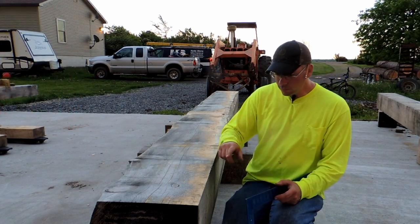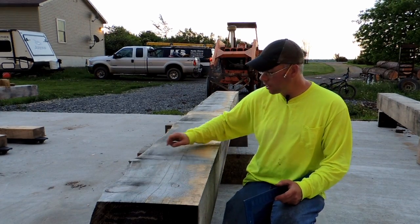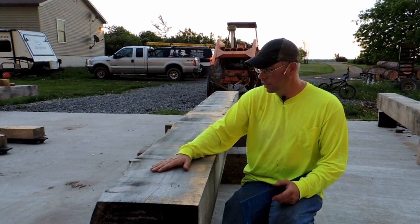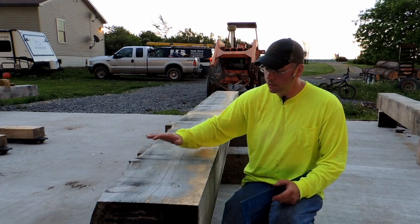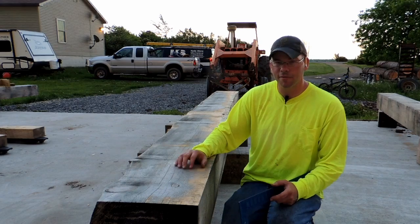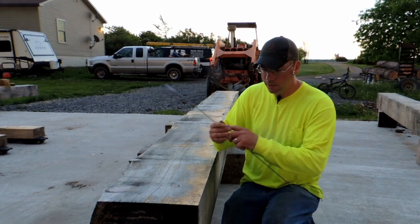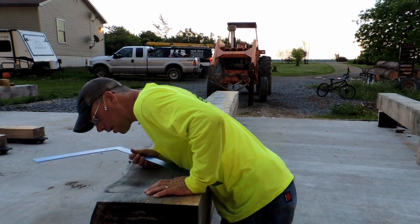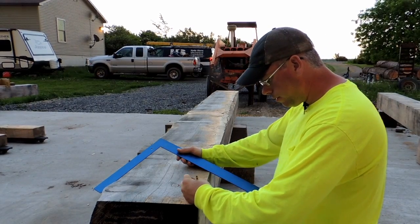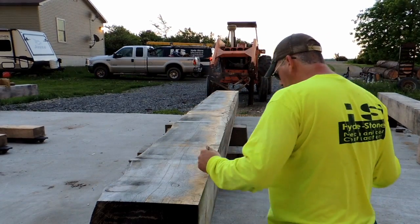How we do that — I'm going to draw square lines down from my reference face so everything's still going to be lined up for the reference face. Because if this side's out of square, and I know the bottom's a little out of square, if I try to do my lines based off of this side, it's going to throw things out of whack. This one's going to be kind of hard simply because of that wane — that's actually going to be a real pain to deal with.